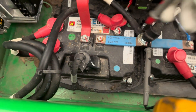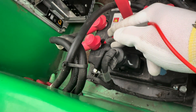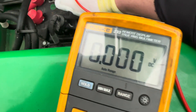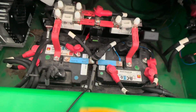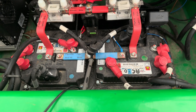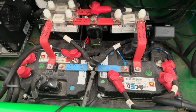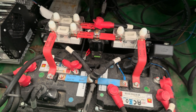Now on the slave controller — checking the phase wire — on the first phase I have zero volts, on the next phase zero, and the following phase zero as well. That's interesting — I wonder which reading is correct.